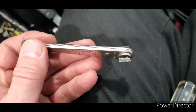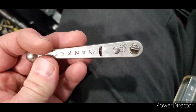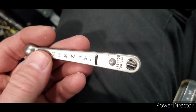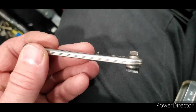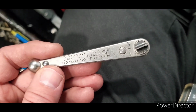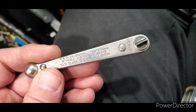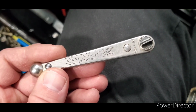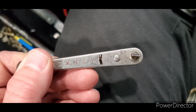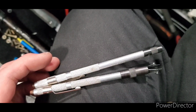Another take on the right angle screwdriver. This is one that has two different size slots. Is reversible. They come in Phillips as well. I've seen them. I don't own one. Every now and then it's handy, but rare, and it's just one of those things, especially if you're in GA. You're going to need the biggest variety of tools you've ever seen. The bigger the aircraft you work on, the fewer tools you're going to need. And for bug smasher work, you never know. And I have had a few times where this did work and nothing else would get there.